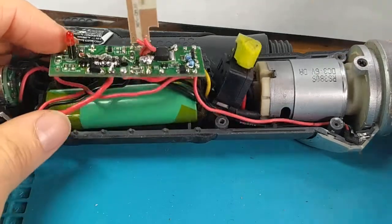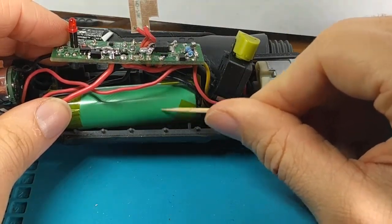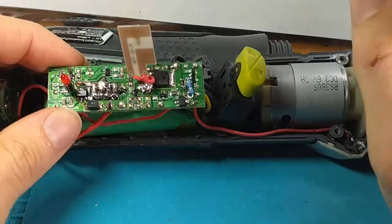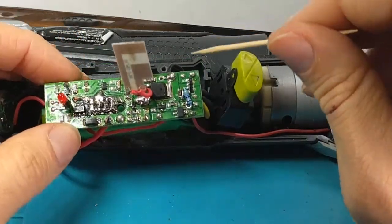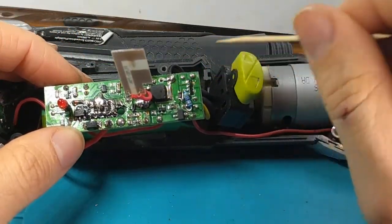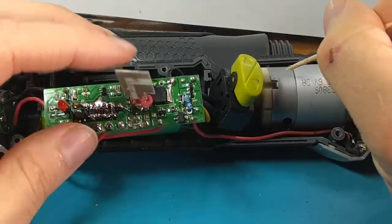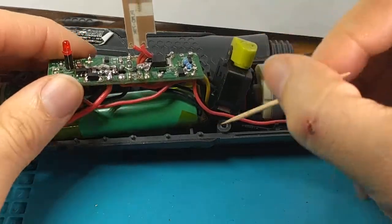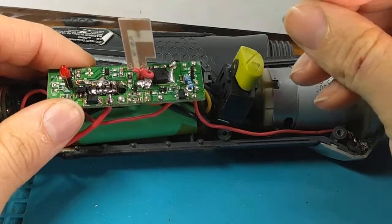This is a 6-volt motor, but it's running off only a single 4.2-volt maximum — a fully charged 18650 lithium-ion battery cell. The more you can keep the voltage higher, the better the motor will function at its optimum. Ideally you could put a really advanced controller here with a step-up voltage converter, but there's not enough space for that, and it's not necessary.